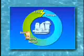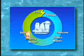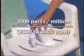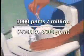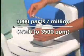Adding salt to the existing pool water creates an electrolyte, which allows a chemical reaction creating chlorine when low voltage electricity is applied to the titanium plates in the electrolytic cell. You no longer have to buy chlorine from the store. Determine how much salt must be added to the water according to the table in the owner's manual. The ideal salt level is 3,000 parts per million, in a range between 2,500 and 3,500.